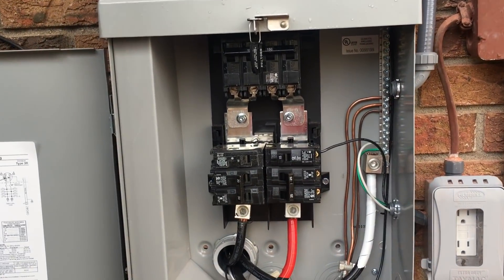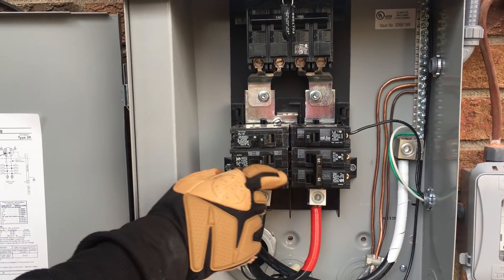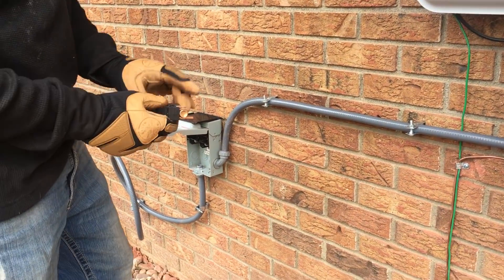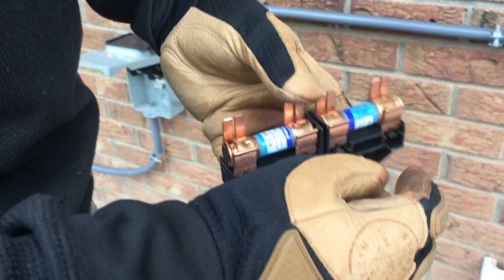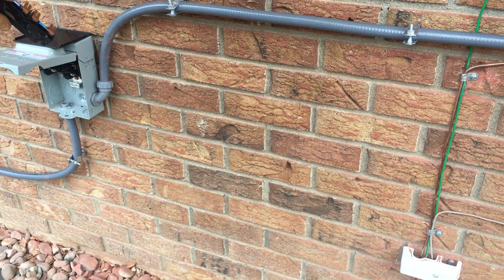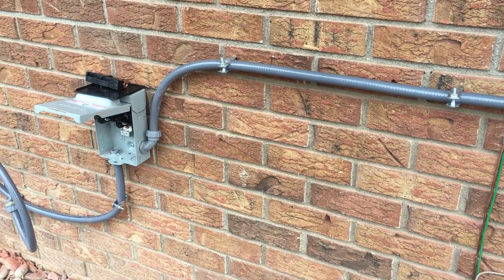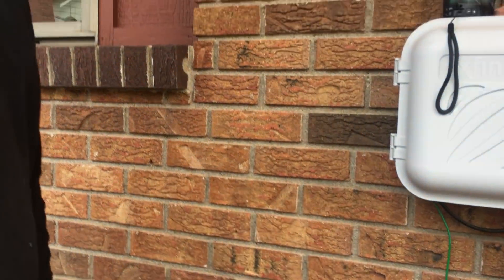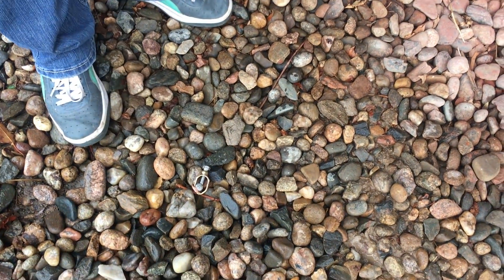We did all this because they're putting in a 25-amp mini split and a 30-amp AC freestanding unit. When I do my ACs I always bring my fuses — it's an FRM 30-amp — so I always fuse my disconnects for the ACs so they don't hurt the panel. You always have to know ahead of time the minimum circuit ampacity and the max circuit breaker. Right here is our ground rod — in my city they only require one, but other cities I work in require two.